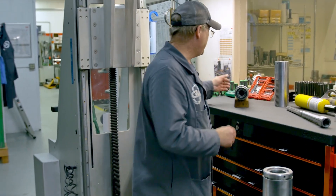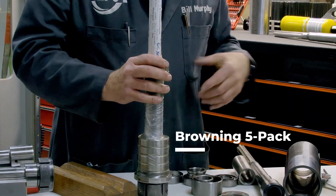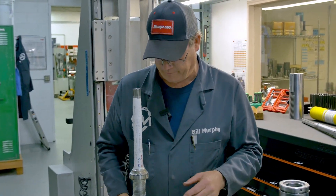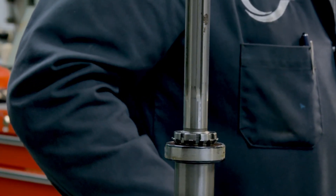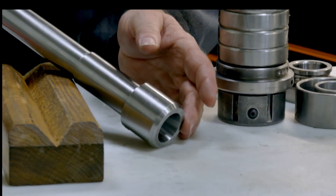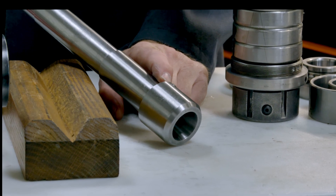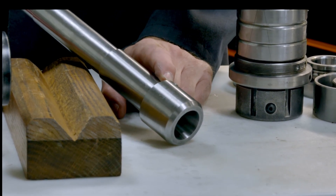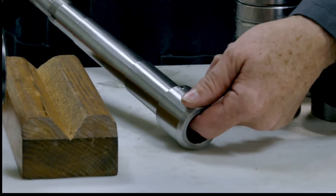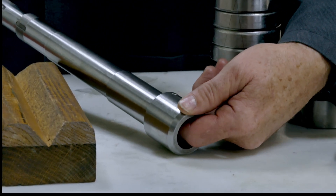What we're going to replace that with is what I call a Browning 5-pack — it's just four bearings down here and one bearing up here, hence the term five. Browning because Raleigh E. Browning is the one I learned it from. You'll notice the nose cap is a quick-change type. You know it's a Bridgeport because it's got that 45-degree angle down here. It does have the collet screw in there — personally, as a machinist, I hate that little collet screw. I want my collets going up there grabbing the taper and being a little more accurate. I take it out for my own mill, but you can have whatever you want and I can set it up for you.